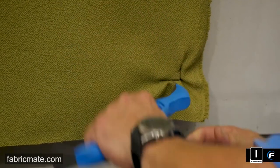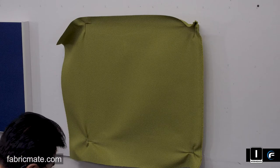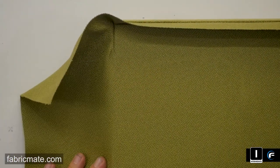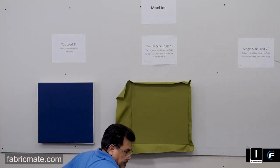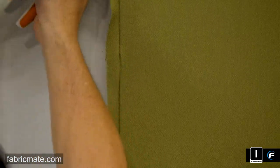Here we're taking out the 4-in-1 again to tuck the corners in. What you're doing here is looking at the panel — making sure that the weave, if it has one, is in proper orientation, no flaws, no soiling. When you have a big wall going, stand back and take a look. Now he's breaking out the roller tool for a little soft seating. On large panels, always recommend from the middle out — that way, if there are any puckers, you can roll those out towards the edge. Middle out, middle out. On a 30-foot wall, if you start from the middle and walk out, the pucker will end up at the corner. You don't want to come from the corners and work in — you'll end up with a pucker in the middle and nowhere for the excess to go.